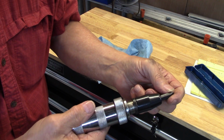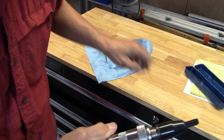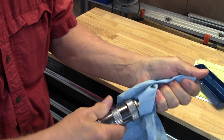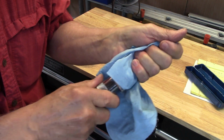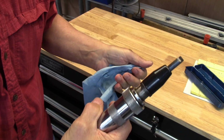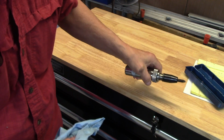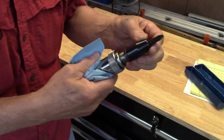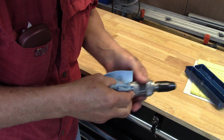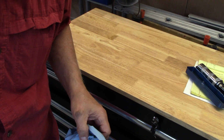And of course, if you want to use this to tighten stuff, you can, it's spring loaded there, you can turn it around, face the other way. And that set it for the other direction. So now that's tightening. And now that's set for loosening. You'll find out when you set it up there and smack it with a hammer whether it's going to tighten or loosen. But this makes it possible to do non-destructive removal of screws in dissimilar metals. It's really handy.